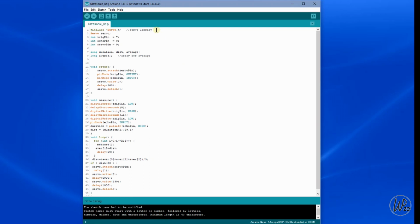Okay, the Arduino code is really quite simple. First of all, you include the servo library. You then declare the pins 7, 8 and 9 as integers for the ultrasonic sensor. Set the trigger pin as an output and set the echo pin as an input. The servo goes to the rest state and delays before the trigger recognises an input. Then you look for a return from the trigger to the echo. Only trigger at a certain distance, does the time and distance calculation.